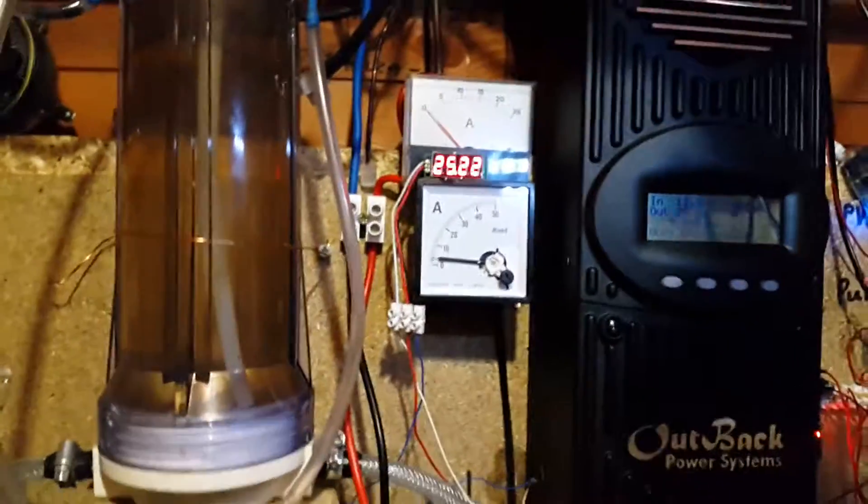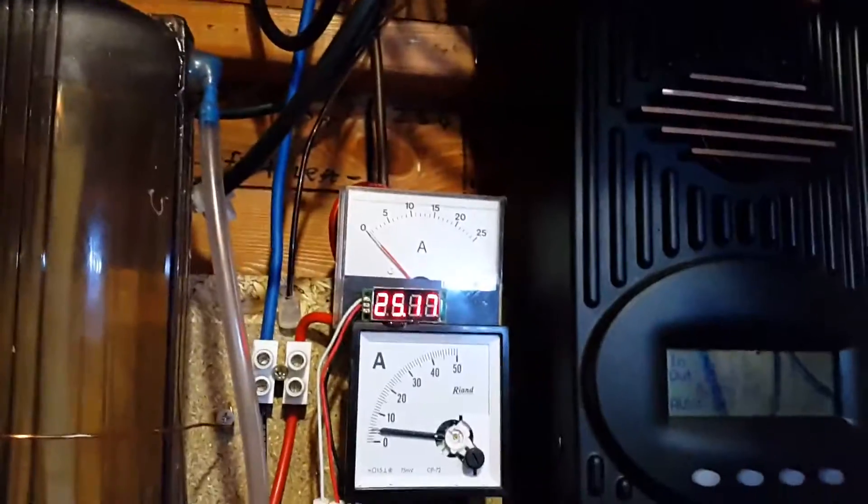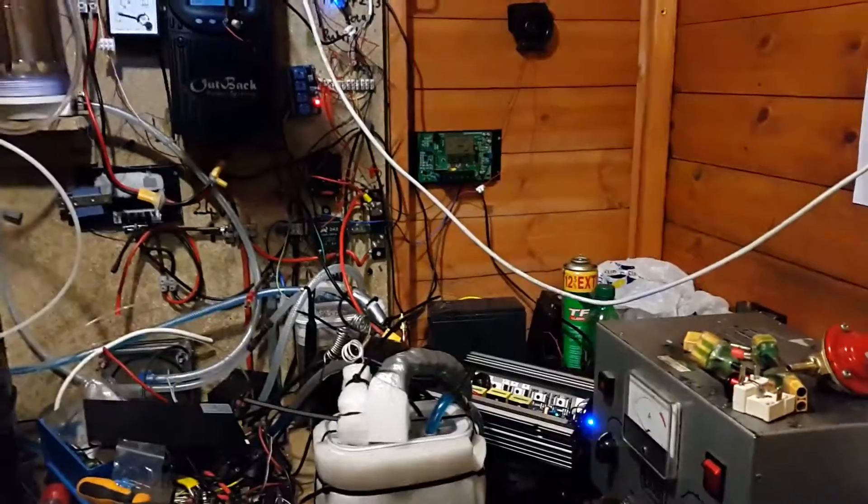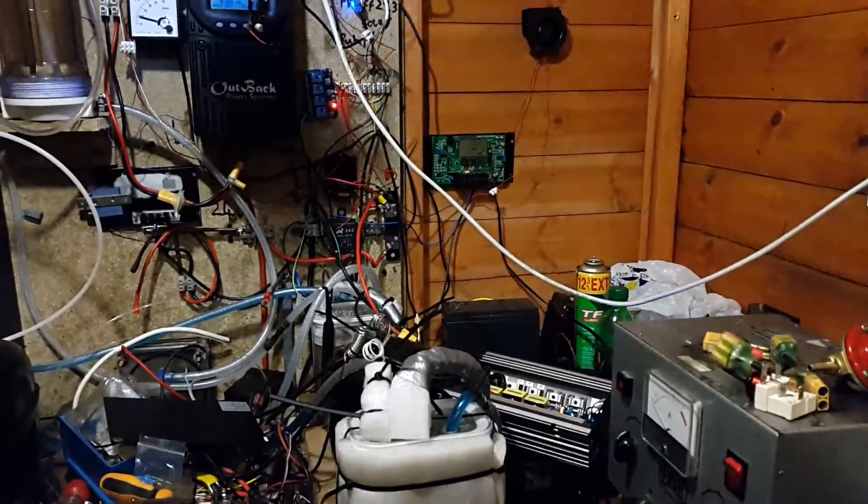The inverter is now set up again. I'll wait until it draws a decent amount of power and is running at maximum power at that voltage, then I'll switch the plug off and we'll see if it cuts out. Normally this RCD would just be sitting right on top of the energy meter, but right now I've got a slightly different configuration — it's still effectively the same thing. Right, I'm going to do the test now — 239 volts.